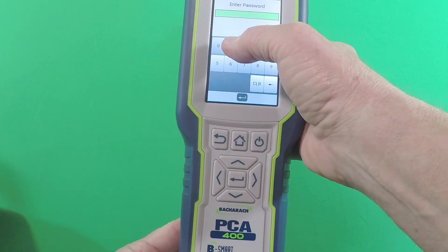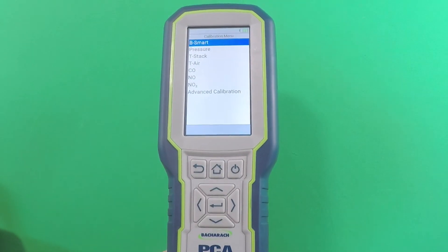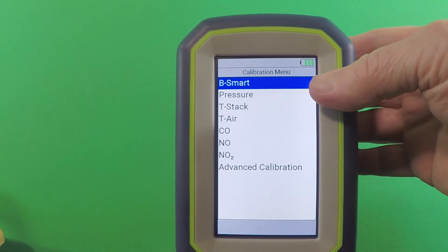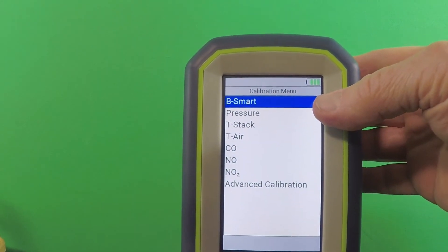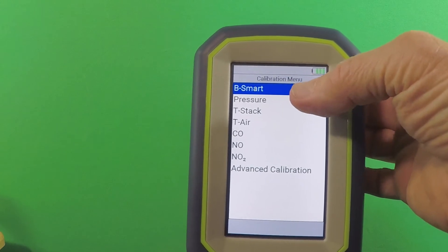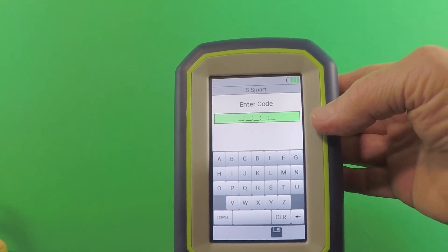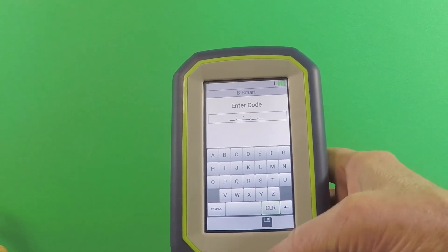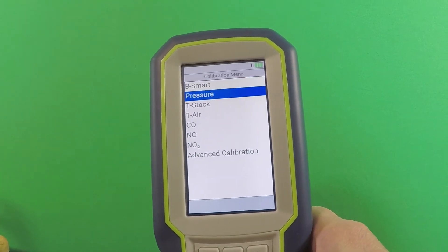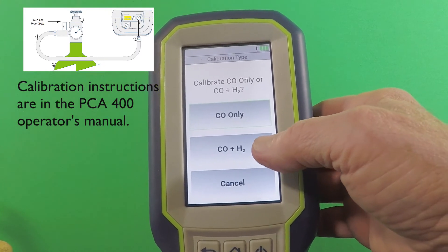Calibration — the password is 1111. The way this instrument can be calibrated: one is with the BeSmart program. You get on the BeSmart program, and when you need the calibrated sensor it will come in the mail. You simply tap BeSmart, enter the code on the sensor, and the instrument will be calibrated — you should never have to send in one of these instruments to have it calibrated. The other option is to do it yourself. We can go down, select the CO sensor, and hit enter. This CO sensor is hydrogen-compensated.